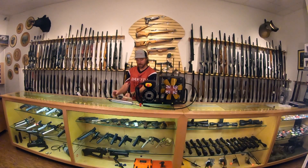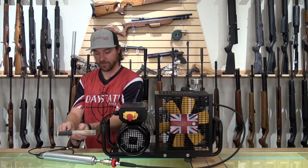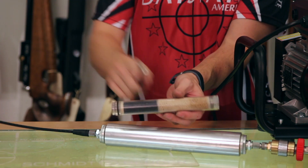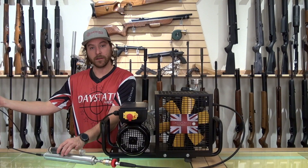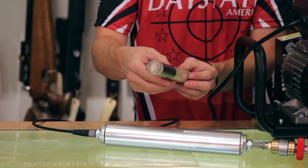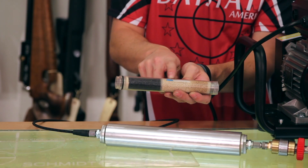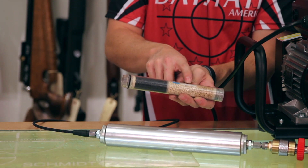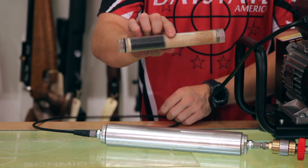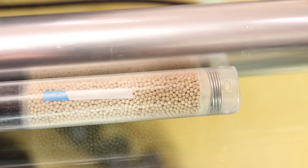The cartridge that sits in here — it doesn't matter which way it goes in when you replace it, but the big thing is on the carbon side of the filter, you want that on your output line — the side going out to your gun or tank. The filter needs to be checked roughly every 30 to 50 run hours. It has a moisture-indicating strip — normally blue, but once it gets moisture in it, it starts to fade. Once the entire strip is white and no longer blue, it's time to change the cartridge. The manufacturer recommends swapping it out every 50 run hours even if the strip hasn't changed.